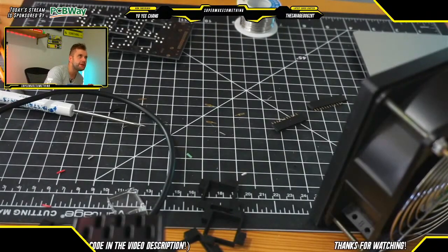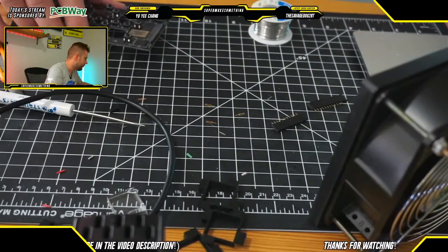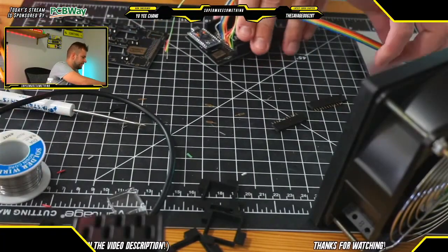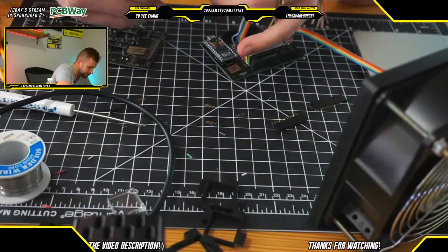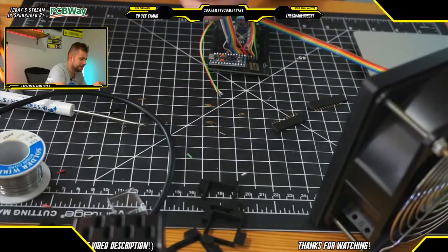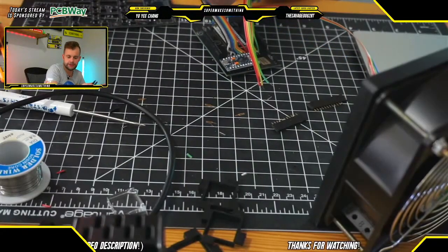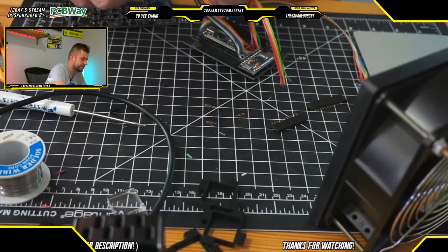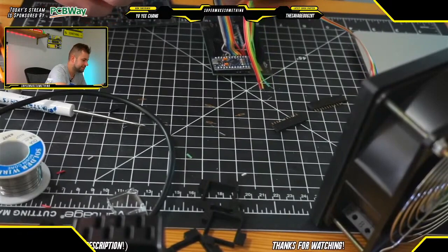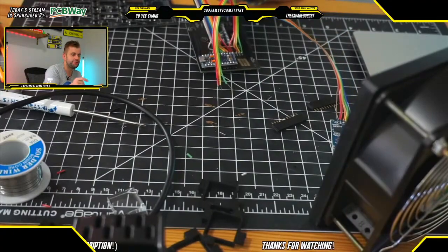The nice thing for me about using Eagle for this project is that it integrates very well with Fusion 360, which is the CAD program, also made by Autodesk, that I used to design the 3D printed components for this project. And I found that very nice because you can have an electrical design, and then you can import that directly into Fusion. And then with Fusion, you can design your case around it. And you can keep kicking the design between Fusion and Eagle back and forth.